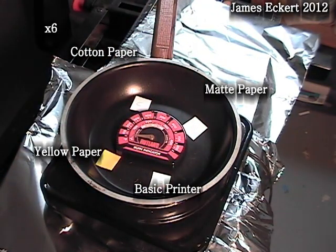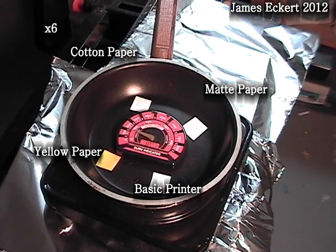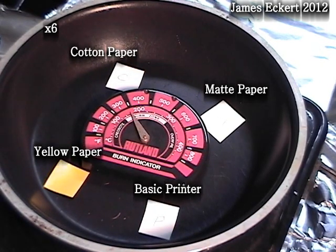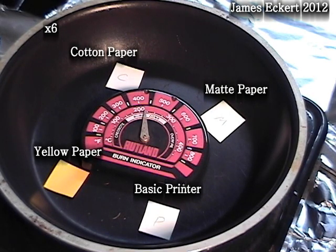When I tried to look up how much heat paper could take, I found answers for auto ignition or spontaneous combustion ranging from 400 to almost 900 degrees Fahrenheit. If 400 was true, all my displacers would have disintegrated by now, although not by outright combustion due to limited oxygen in the displacer cylinder. All my Stirling engines use paper for displacers, mainly because on the first one I needed a quick way to test the displacer size and I used paper to make it, and it held up fine with only minor discoloring on the bottom.